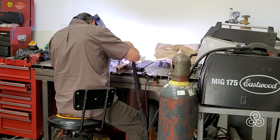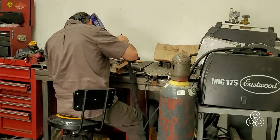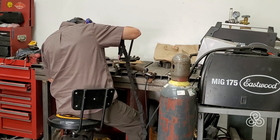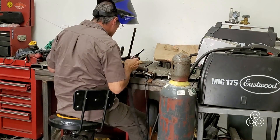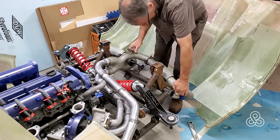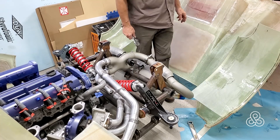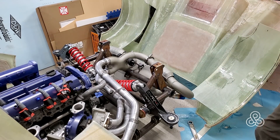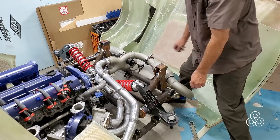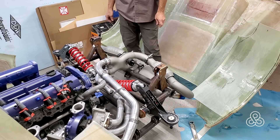Now this subframe needs to be strong enough to hold this front brace to push against what will be the roll bar structure in the bulkhead, and it's going to hold the whole crash structure. The aluminum sheet metal work in the back is the crash structure. To get my final fit on this, there is a little bit of an interference problem with the exhaust system here — I realized I'd never tightened the whole thing back up. Once it was tightened up, I got the clearance I need. Then slide those brackets into place where they're going to be.